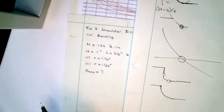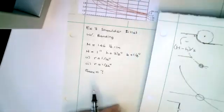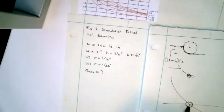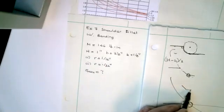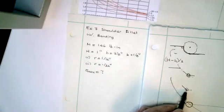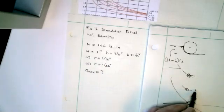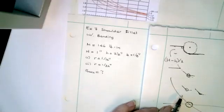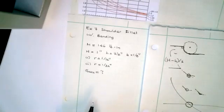Thank you. Okay. Yeah, that makes sense. Okay. So we're going to talk more about why that sharp corner is a bad idea later on. Yes. Okay. We will talk about it. But you'll start to see it. So the radius here, that sharp corner, is literally zero. Okay. But if you smooth that sharp corner, you would have a little radius. And when you keep making this radius smaller and smaller, the radius goes to zero. So that's why it's bad when you have small radii. But we'll talk some more about that. Okay. So you want to round your corners. You don't want sharp corners.